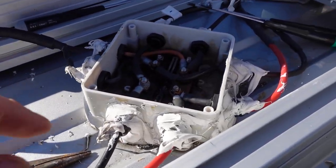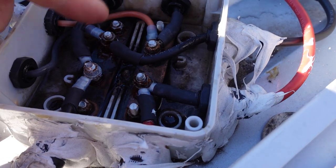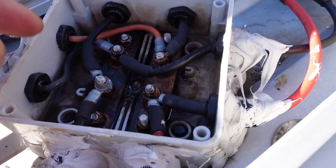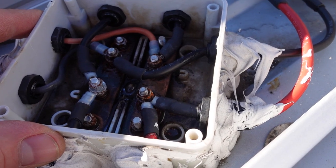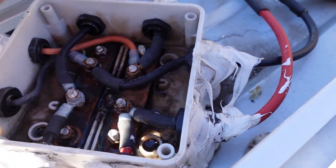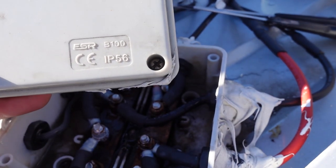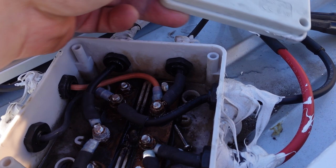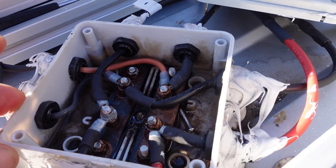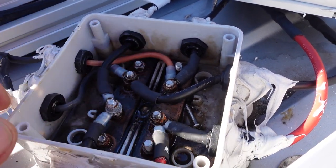So the old box - I've just took the cover off up here on the roof. You can see there's water in there, and these are copper plates for making up the bus bars - you can see they're all corroded. Even though I pretty much sealed it around the outside, it's got condensation all inside the box as well. It's going to cause a lot of problems with the solar, and will cause high resistance on all the junction connections.